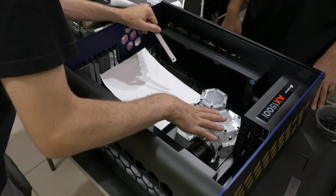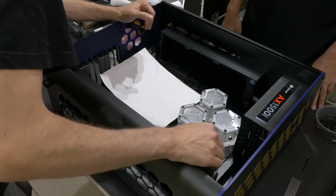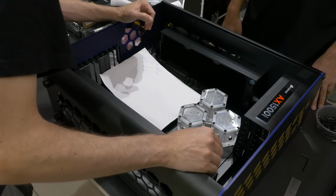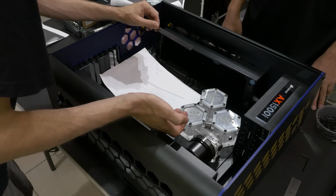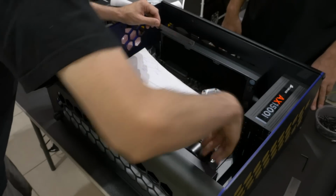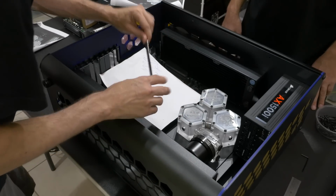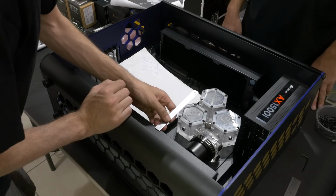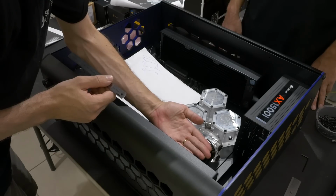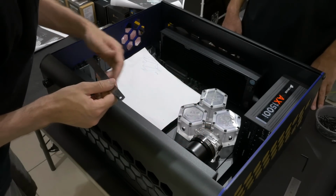So yeah, 85 down, step. And where's that going to bring us to on these radiators? See, that brings us about halfway up the radiators. So it means that the airflow from the radiators is going to be blowing behind the shroud and in front of the shroud, but just a very thin panel, kind of dividing the air, which doesn't matter. I want to have a 15mm gap above. So the shroud will be like here, and it will have a bit of a gap. I don't want it sitting right on this.